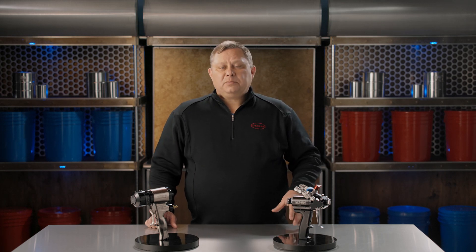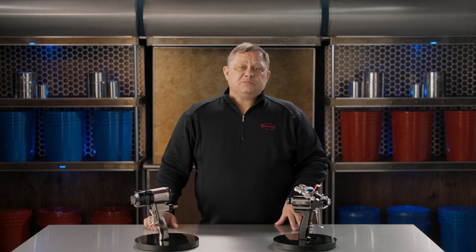Be aware of your air supply — clean, dry air. Moisture in the air supply can interfere with the operation of your transfer pump. It can also introduce moisture onto the substrate while spraying. An air dryer or chiller for your compressed air can prevent this from happening.